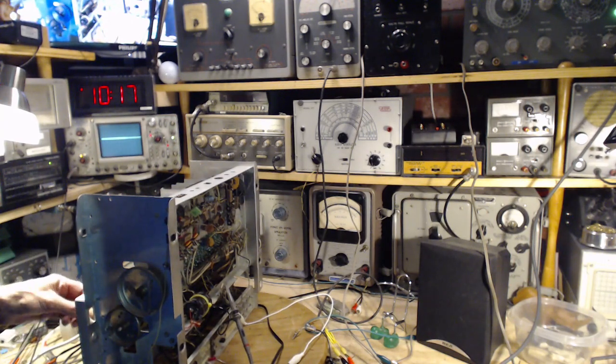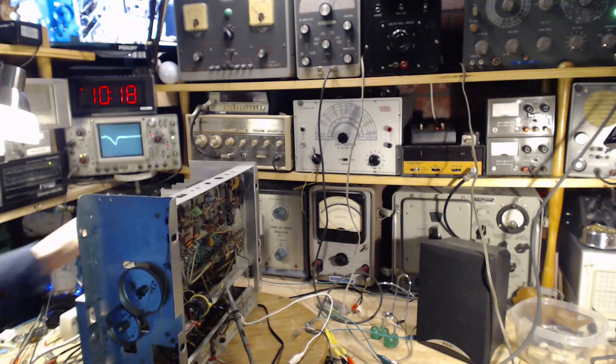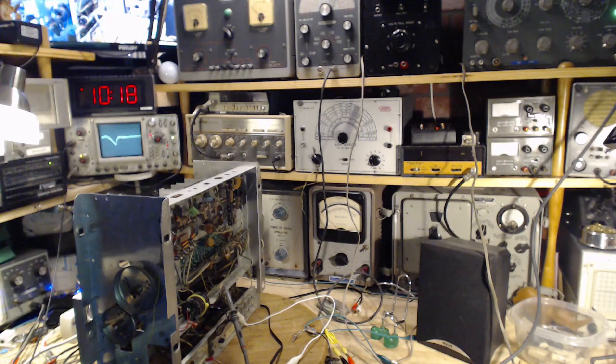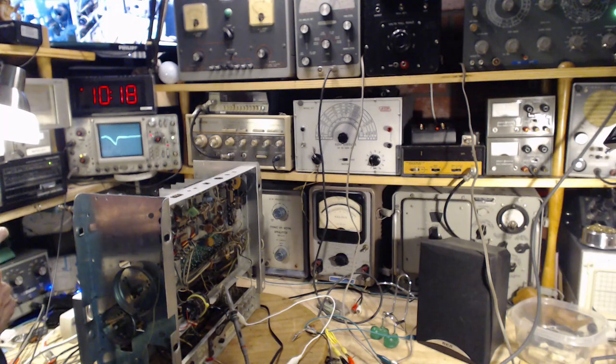Okay, a little further. Something good did come up on the scope. Turn it down. Well, I think that might be the S-curve, only it's a lousy S-curve, isn't it? It looks more like a V-curve. So from here I have to convince myself that the equipment is doing the thing necessary to make the right kind of shape come up there. And then if the right kind of shape doesn't come up there, it must be the fault of the radio and its alignment. That's a pretty tall order to know for sure that all these things are working properly.